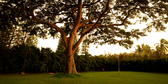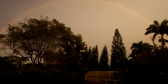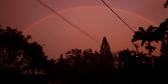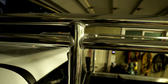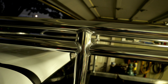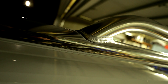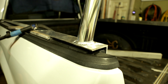Got some nice evening soft light after the storm - it's a pot of gold at the end of the rainbow. Same technique: make a puddle, move over, make a puddle, move over. I'm keeping the gas cup touching the metal so I can keep the arc really, really short - just moving and grooving. There's the front - almost done, very tired, it's been a long day.